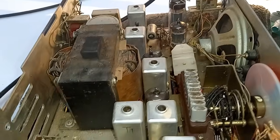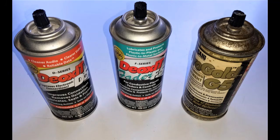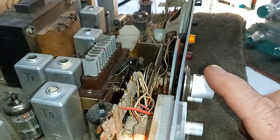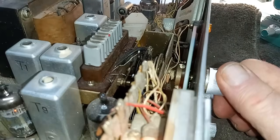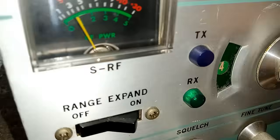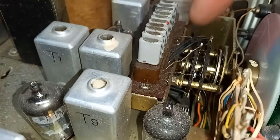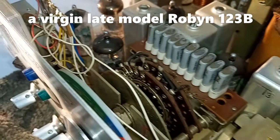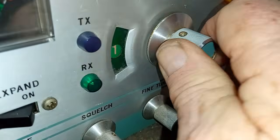Okay, I've pulled all the hacks, removed this switch from back here, torn out all that bogus wiring, put all the crystals back in where they go, and listen to this. Got a signal generator. Just by putting pressure on here, either got a bad soldering connection, a bad ground, and the signal generator's on channel 11. This is on channel 14. I'm guessing the crystal assignment on this might be different, as the pinout from the crystal sockets to the actual rotary switch is different than this bone stock one here. And the selector switch has been deoxed several times now, so it's got some issues.